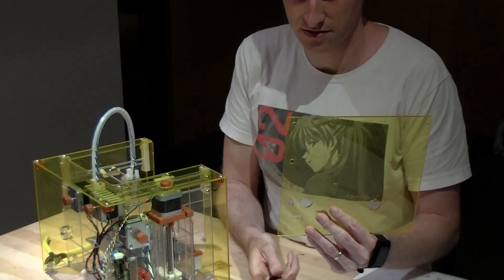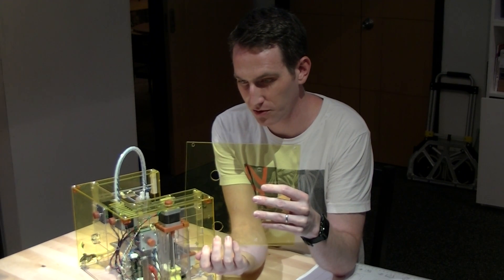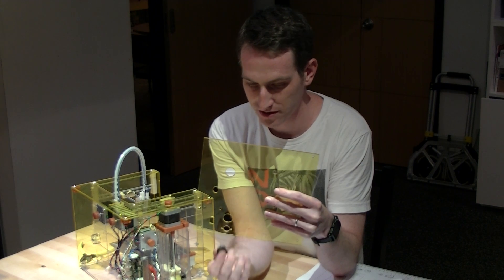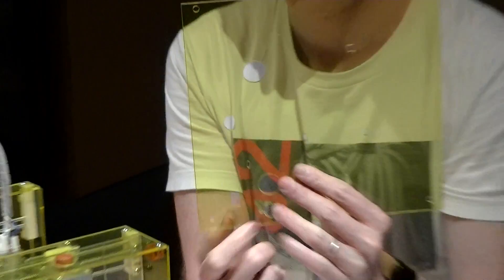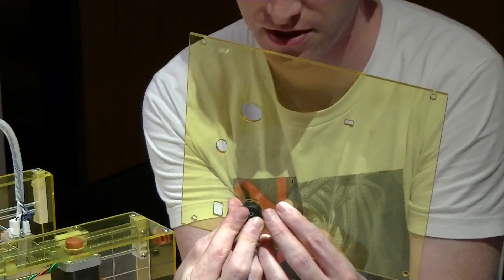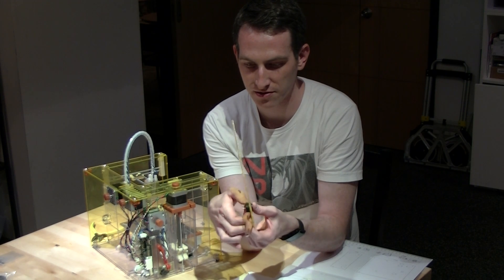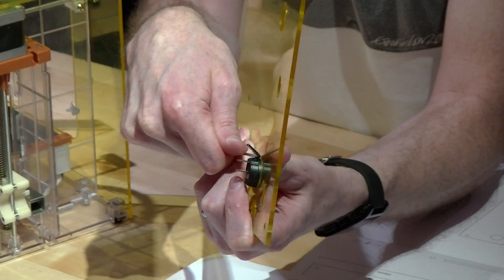On the outside, if you're looking at it this way, you have the big hole, a smaller hole, and a couple of other features and another big hole up here. The switch is located into the hole with the notch. Looking at the back side, you're going to put it in — there's a notch, or a tab, on the side of the switch. Just start pressing it in and it should pop right into place. You may need to pinch these side tabs, kind of the loops on the side of the switch. You might even need to use a tool to press it down to get it to seat easily.